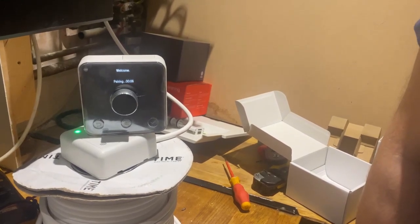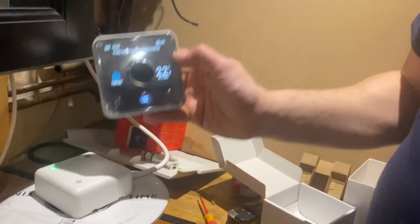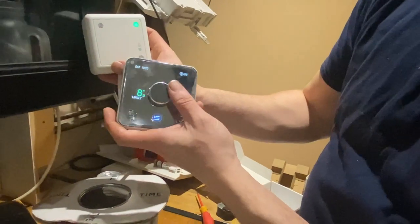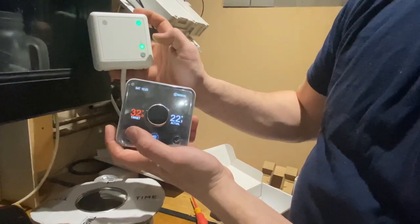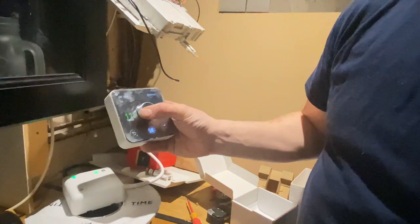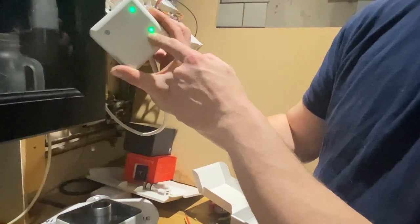That's pairing now — that, my little friends, is how you do a Hive. Just to prove it works: I've just turned the boiler on so it's going through its little purge. I'm going to turn the temperature up above the actual room temperature — let's have it at 32 degrees. As soon as I press that, the green light comes on telling the boiler to kick in — we can hear the boiler fire up now. Then if I turn it back down to 11.5 degrees, it starts flashing saying it received the signal, and the boiler will knock off. Everyone's a winner — you've saved 70 quid. Hit the subscribe button!